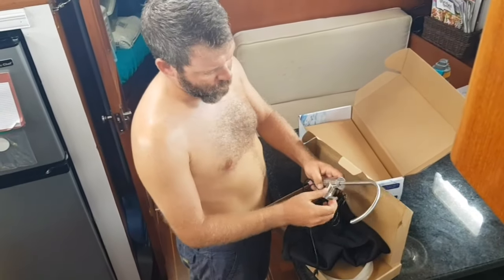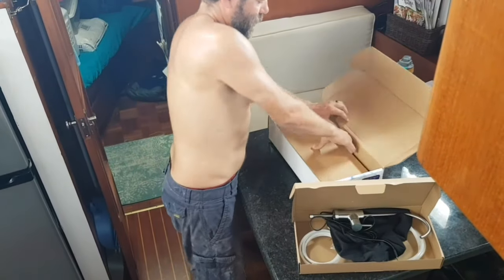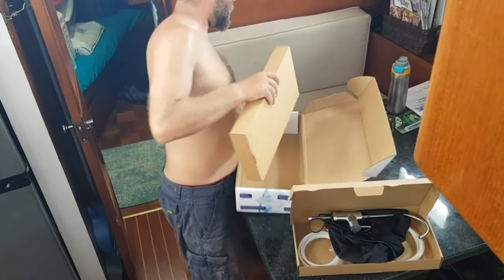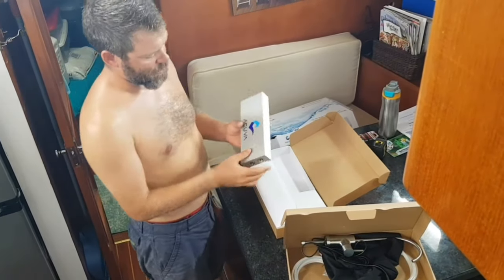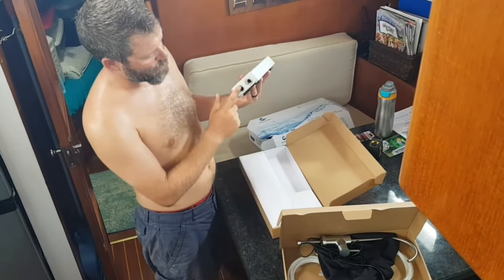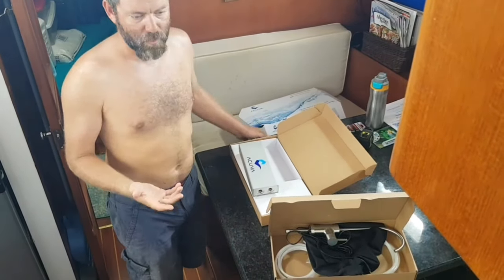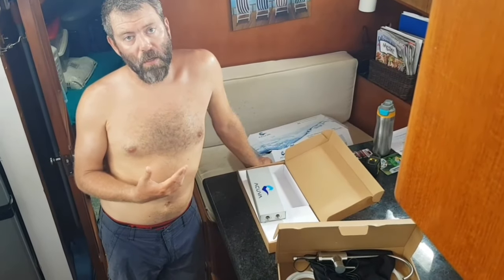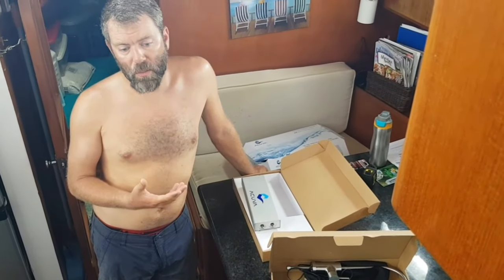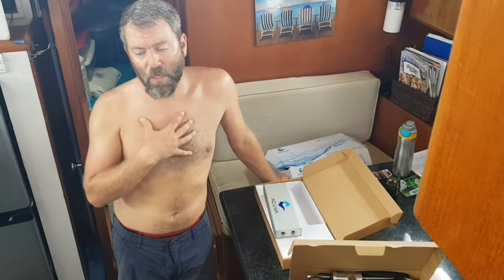So when you turn the water on, the UV light comes on in this contraption right here. Inside this is LED lights. Water flows in, water flows out, water flows to our spigot. Since we're making a lot of our own water, there's not always a great way to decontaminate. So we want to make sure that whatever comes in our tank or could be growing in our tank doesn't get to us.